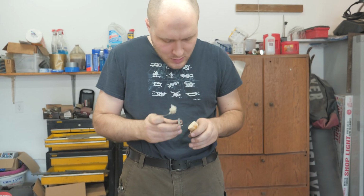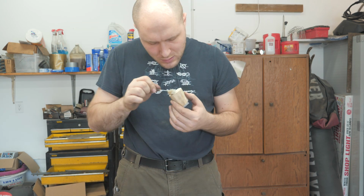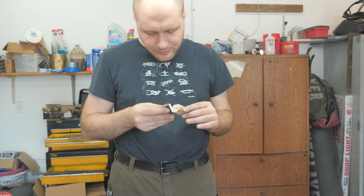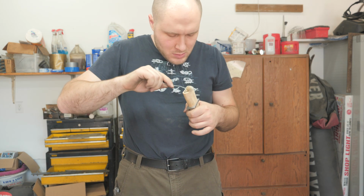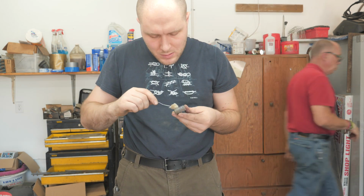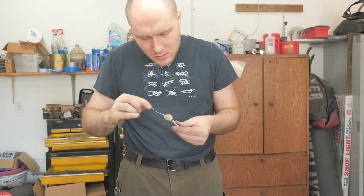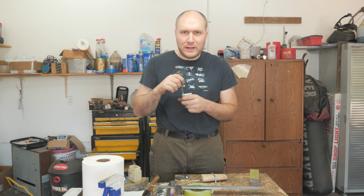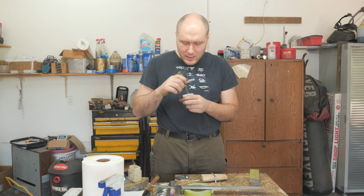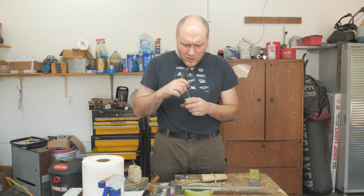So now I want to bed the ivory in epoxy. So we're going to take it apart and cover any parts that we don't want sticking together with Vaseline. Fill the ivory sections up with epoxy and let it set up. I'm using West System epoxy here. Some super high quality stuff, like the best quality epoxy that I know of for doing this kind of thing. It takes a long time to set up.